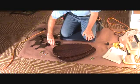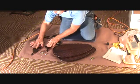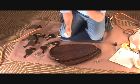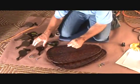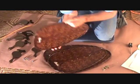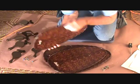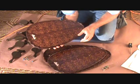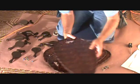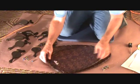Okay, at this point, make sure you look at the directions, because we've got two types of brackets to install on these fan blades. So make sure you look at the directions and figure it out. Look at your fan blades, because there's a front and back. Sometimes there's one side one color, and one side another color, so you can determine which side you want facing down. These don't have that, but it says this side up. So I know this side is going to be facing up.